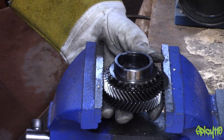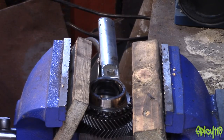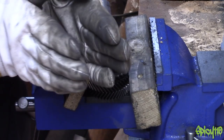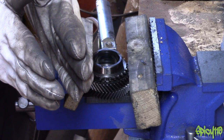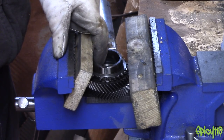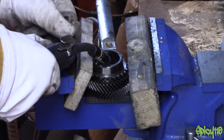I feared this would be a problem. Giving this is quite heavy and I need these to penetrate well. I'm going to turn it up and wire speed back very slightly. I'm now a little bit concerned thinking about this, because I've got two interior walls like this. When the weld goes between, it'll expand and then when it contracts and goes cold it'll pull. I don't want it to pull across that way — there's a lot of force. I don't know exactly what it is, but shrinkage on a weld is in magnitudes of tons or something stupid. Well, we're just going to have to go for it.